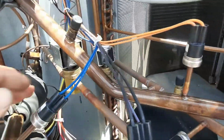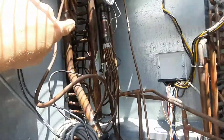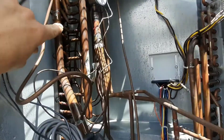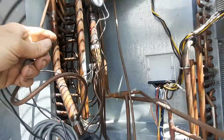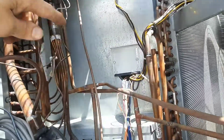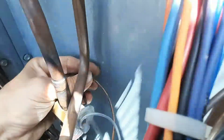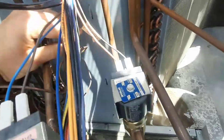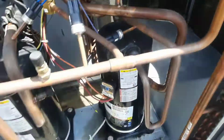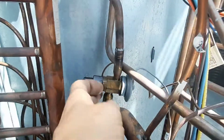I might have to throw gauges on this and see what it's doing. There's a sub-cooling coil and solenoids inside, so you can have straight cooling mode — a call for cooling — and de-hum goes to sub-cooling mode. It feeds through check valves and then feeds back, and then just straight de-hum, which is hot gas that sends the discharge gas over to the reheat coil.